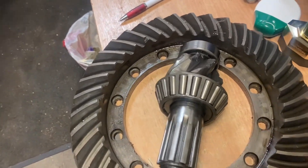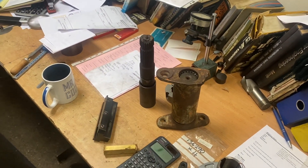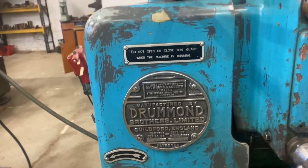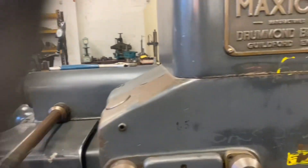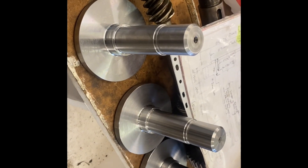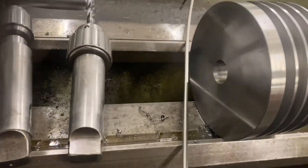Anyway, that's what I brought up - the Mack pinion and crown wheel. The man's going to have a look at it and see what he can do. There's the other bits I sent up - the 1250 shaft which hopefully we're going to get sorted and prepared, and there's another shaft there for the PTO extension. Just look at this - manufactured June 1961, Guildford, England. There's the next set of short shafts being made ready to be splined and then sent off for hardening, and the pulleys are being done at the moment - machined out on the back, then the splines cut.